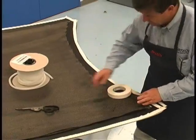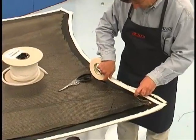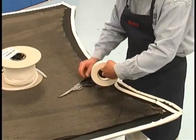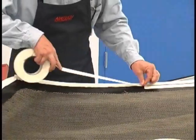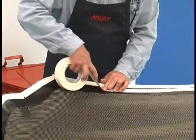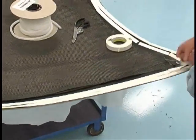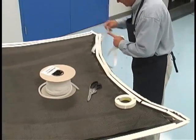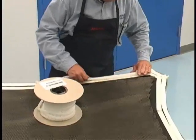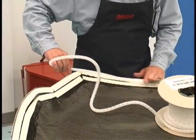After that we apply a double-sided tape, such as Airhold 10 CBS. This allows us to later secure the polyethylene spiral wrap required for a peripheral vacuum manifold. The spiral wrap is then applied to the periphery of the mold, just inside the sealant tape.